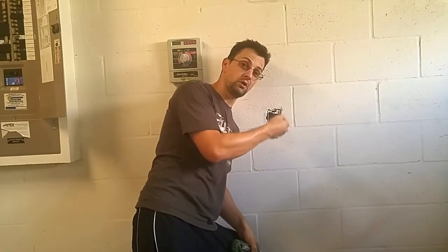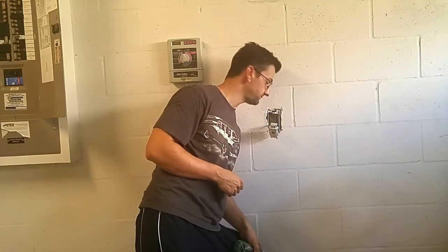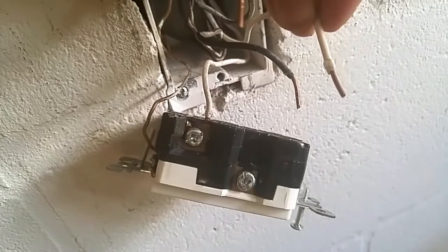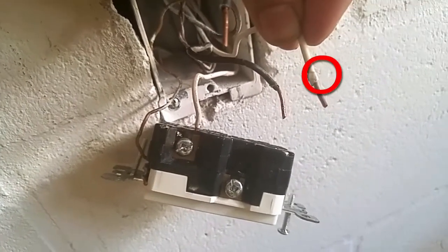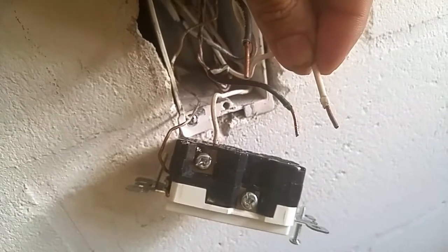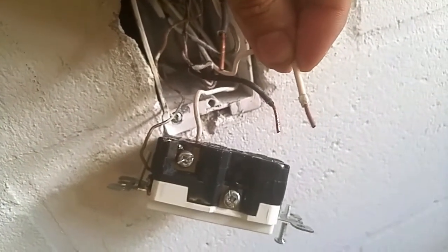You want to make sure your line and load wires are wired correctly. What is this? That is unbelievable. See that flat mark on the neutral wire? That's what the screw was touching — it was not touching the copper. They inserted it too deeply before they tightened it, and it wasn't making contact. At least not well enough. That's a fire hazard. Don't make that mistake.